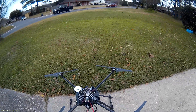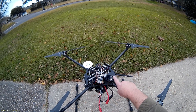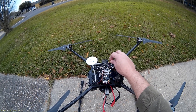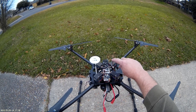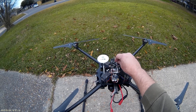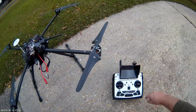I've also temporarily installed a telemetry module on this. I was able to splice into a socket — a plug that goes into the data port of the FCS 800 flight controller — and it gives you direct access without any modifications, other than making you a wire, to telemetry and on-screen display if you want to run that on an 800.